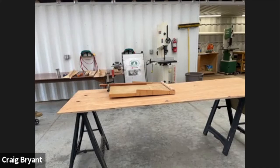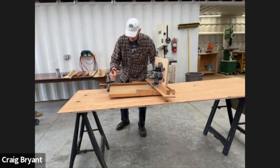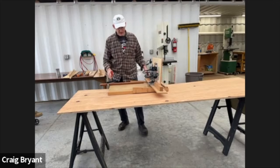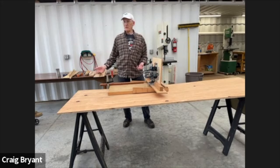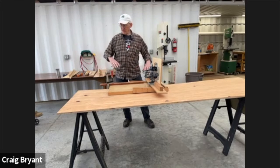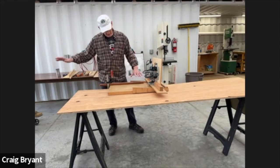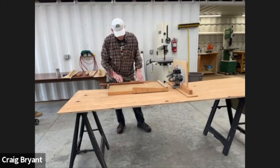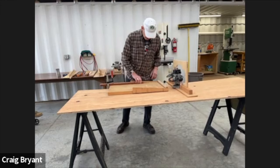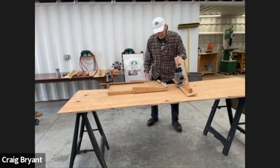So this works with this. And I usually just set it on sawhorses and clamp it down, and often I'd have a 10-foot plank. The nice thing about this is the plank doesn't go anywhere. I have an auxiliary outfeed roller for my table saw that I'd set out there to get the plank level. I just put in a short piece that I might want to cut a scarf on, and this just happened to be the plunge router I had.